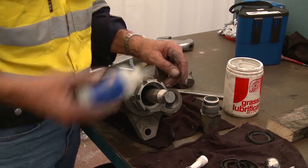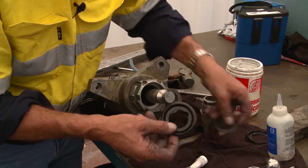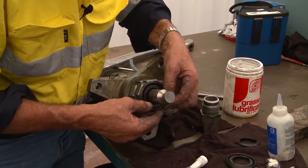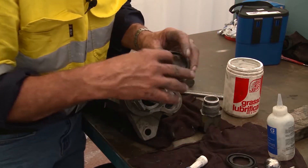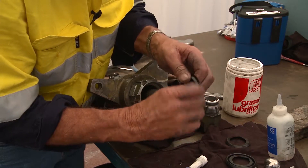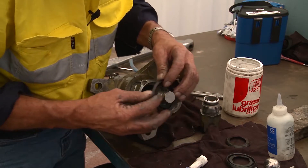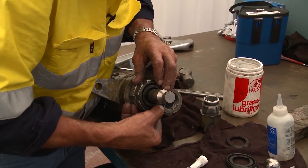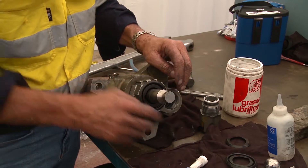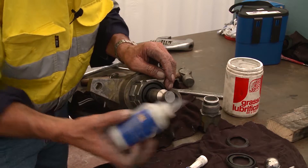Once installed, put throat seal oil in there to lubricate those packings. The kit comes with three different types of dust seals. The smaller one doesn't fit. The chevron-type seal pushes into the ring land — you push it in and hear it click into place. It's just a dust cap with two cutouts so you can lubricate it.